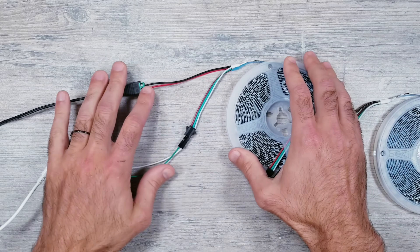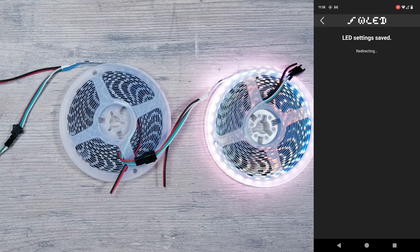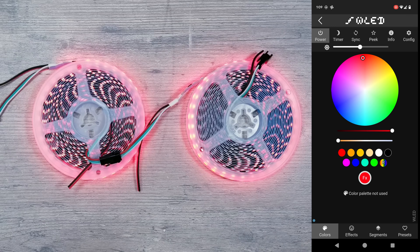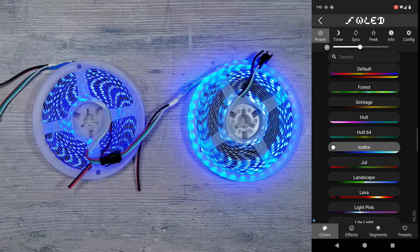Next let's plug in the second roll. Once connected, go back into LED preferences and change the length to 320. Here you can see the significant voltage drop when having things on pure white. But on colors other than white and on animations, things look perfectly normal — something that would definitely pass my level of acceptability for the types of projects I do.